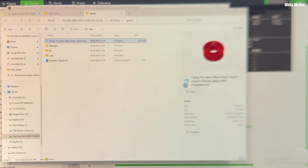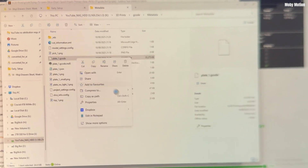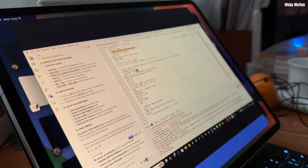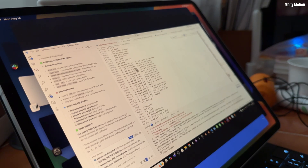I was a bit worried about the Bambu closed-off ecosystem — what if you can't even export g-code or run g-code? But luckily all of that is possible. I figured out how to export the g-code; you have to unzip it as it's in a weird .gcode.3mf format, and there is a .gcode file within there. But when I opened it, it terrified me — many millions of lines of code I'd never seen anything like it. I thought: LLMs can help with normal code, so let's see if they can help with this specific g-code problem. So I opened the code in VS Code and cracked open GitHub Copilot, described the problem, and asked it to fix the g-code for me.